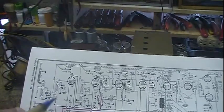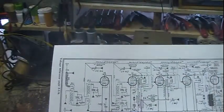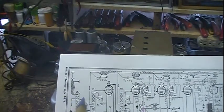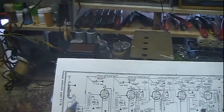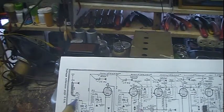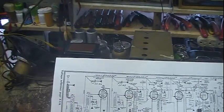But it still wasn't what I thought it should be. Most schematics are drawn the way the engineer envisions how the coils should be wound and the number of turns. If you notice on this one, you've got what appears to be a couple turns and then several more turns on the secondary. This was actually — and I went back over my pictures to double check — this was hooked up in reverse. The antenna fed into the part of the coil that had the most turns, and then the one with the least number of turns would feed the next transformer.